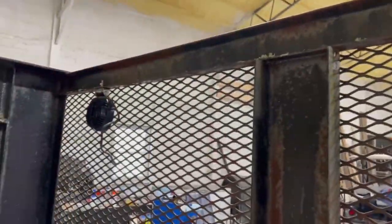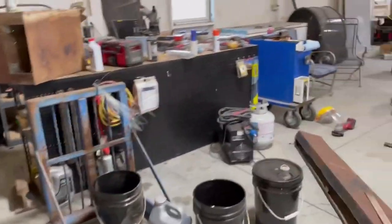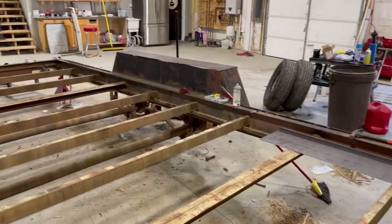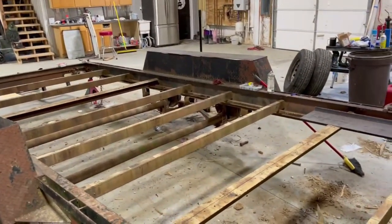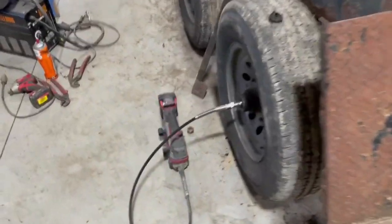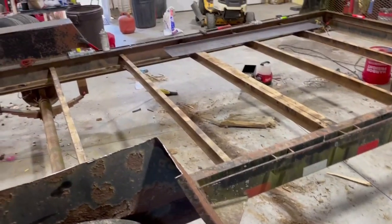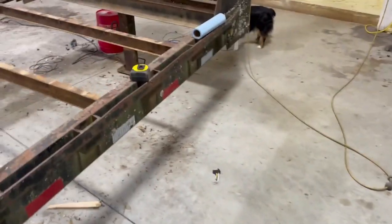We're adding LEDs up here so we have something to look at, and we're putting a switch in the battery box for the breakaway to keep it safe. For anybody looking for a cheap way to rewire a trailer without making your own home runs, we bought a universal five-way wiring harness at Rural King, then added two wires for the seven-way for the lights and brakes. The tires are on - finished greasing them up and they're much tighter, not as sloppy as they were.